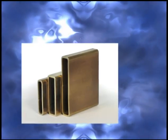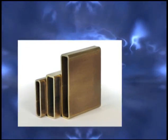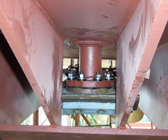Duracooler is manufactured using 90/10 Cupro nickel tubing and is resistant to water flow erosion. The copper in the tubes serves as a natural antifoulant in conjunction with cathodic protection. The compact one-piece design facilitates easier installation, and the specially designed flange mount eliminates through-hull installation and the need for a coffer dam.